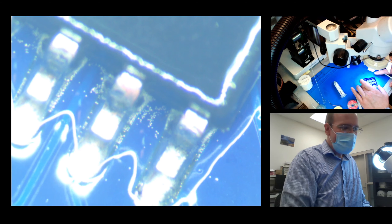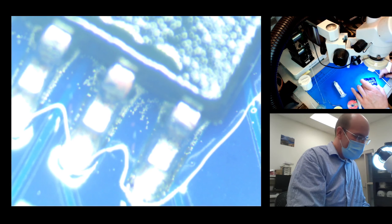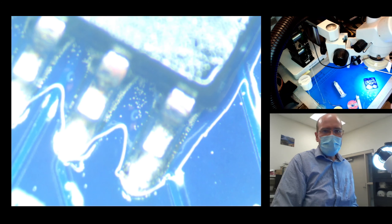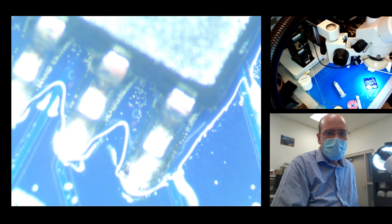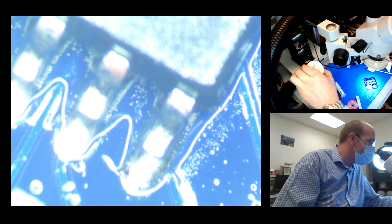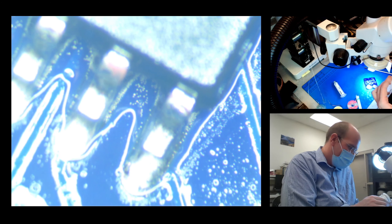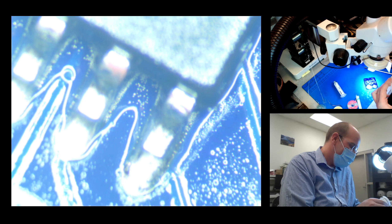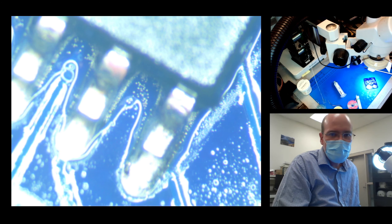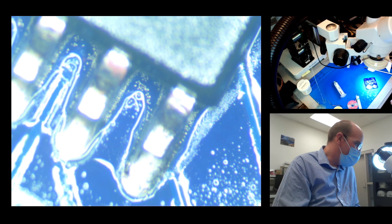It's neat — you can see those little individual solder balls in there. The price you pay for solder determines the size of those individual grains. Very expensive solder has very small individual grains; cheaper solder has larger grains. This looks about medium size — this is T3 solder, relatively cheap stuff. If you're working with really tiny components and high-resolution commercial parts, you want very fine grain solder balls. Thanks for watching everybody.